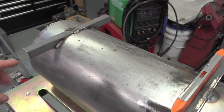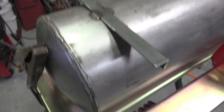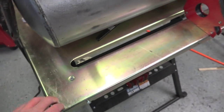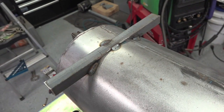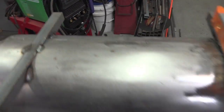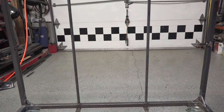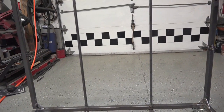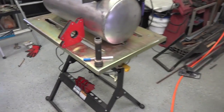Got the other brackets cut and got them welded on - shed the weld on a little tab there. It wasn't grounded off the table too well, but now those are done. We'll drill four holes in these, get it clamped up there, mark them out, and then I'm going to weld bolts onto those two rails. That's where the tank can be put on and off, so after it's all painted we just slide it on and put a nut and washer.